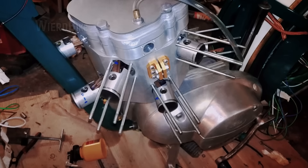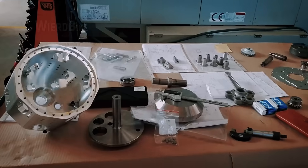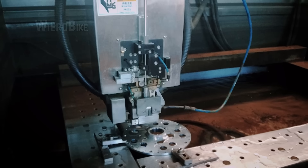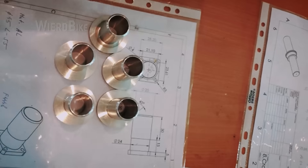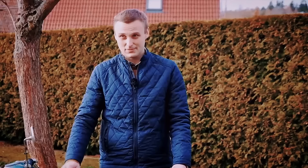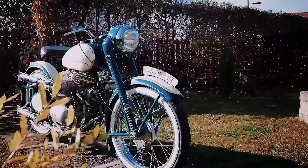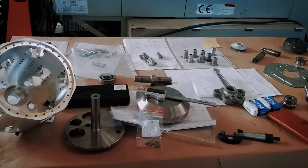To prevent the engine from overheating, the pistons and combustion chambers were coated with a ceramic layer. The engine crankcase, crankshaft, supercharger housing, and main connecting rods were manufactured on a CNC machine. All engine parts used are authentic, sourced from Jawa motorcycles — standard pistons can be used. Every part that's custom-made is five times, sometimes even ten times more expensive. You have to wait for it, and there's a huge potential to make a mistake, because mass-produced things have already been perfected. Anything you make as a one-off custom order, you never really know if you designed it perfectly or missed something.